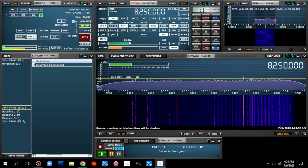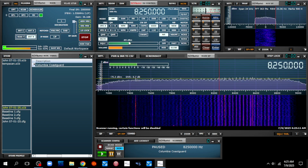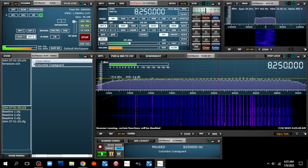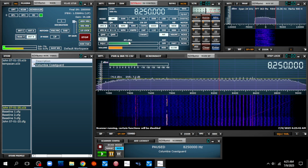I can do that right now, and then I'll stop this show. Okay, I'm going to switch. I'm on the K-480. I've got the gain turned all the way up. It's in the HF band. So I'm going to switch adapters. Actually, there is a battery in the amplifier, so I can disconnect the USB right now, because it should be fully charged. So we just disconnect it. Watch the screen. I can't get my hands on it. Okay, I disconnected it. Didn't help. So it's not the power supply. So I've eliminated that. Connect it back up. And no, so it's not. I've eliminated that. It's not the power supply.